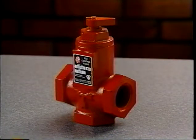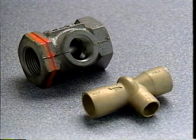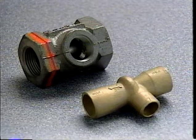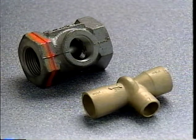A flow control valve prevents gravity circulation of system water when the circulator is not in operation. The flow control valve allows system water to flow in one direction when the circulator supplies system pressure. These valves are particularly useful when the boiler is providing domestic hot water or feeding another zone when zoning with circulators. One-pipe fittings are used with one-pipe systems and are installed at the connection of the system main and the terminal risers. These fittings are used to divert the water to and from the terminals.